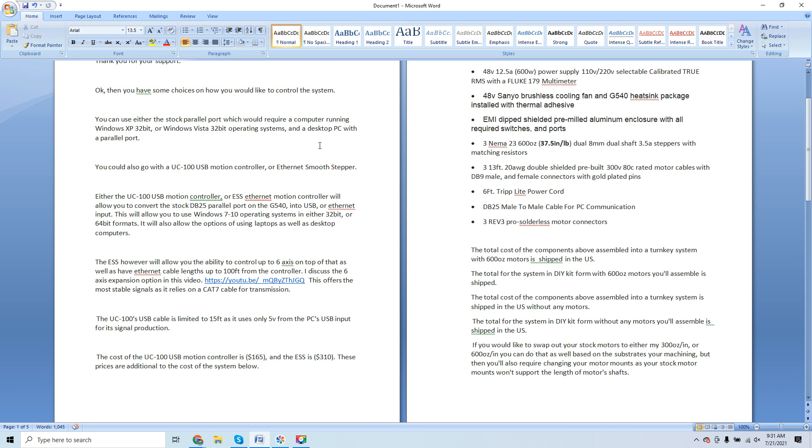The older the neurological center of your CNC system — meaning your computer — the more problems you'll likely have. Even using modern motion controllers like a UC100 or Ethernet SmoothStepper, always upgrade your computer first. I've had instances where someone running a full Bridgeport mill was using a 1980s control system with a 486 computer and floppy disks and then wondering why their business wasn't progressing. We cannot use archaic technology — if something fails, your business model is done. Be proactive, not reactive.